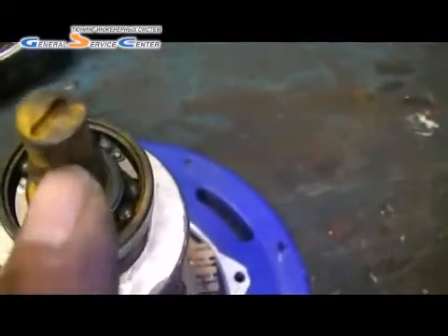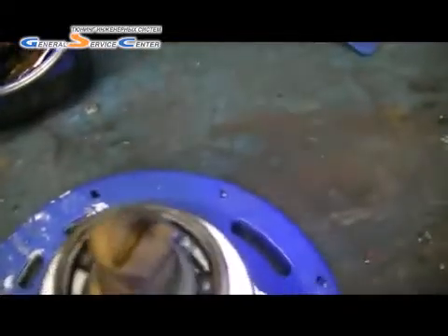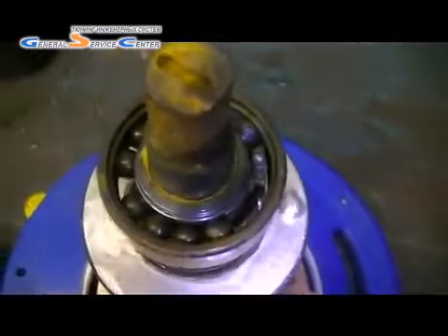It's gone that hot because it's running without a fan — there's nothing to cool it down. It's basically completely destroyed it and bent the motor. You can see the bearing quite clearly on there. There's actually a piece missing from the motor here — yeah there it is, that's the other piece. That's what attaches to the windings. So yeah, that's the mystery solved — it's a bearing failure.